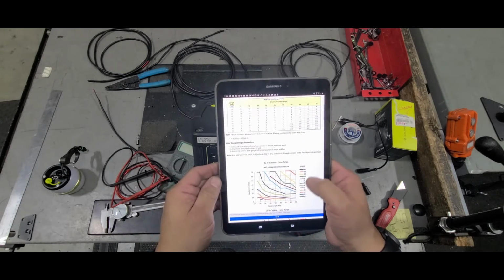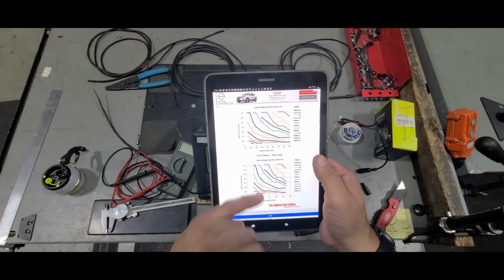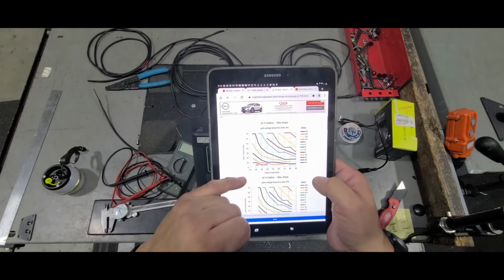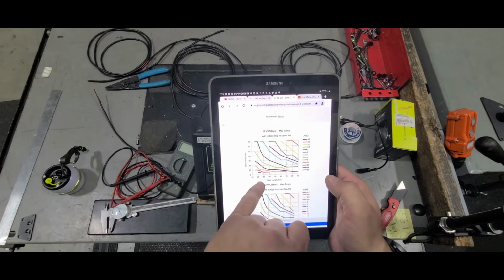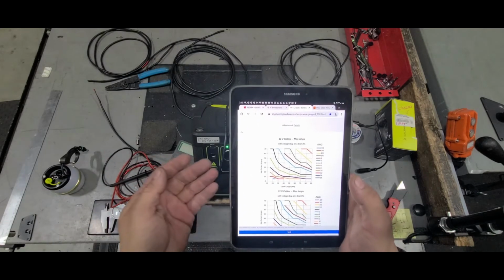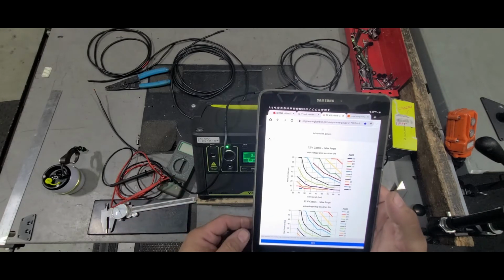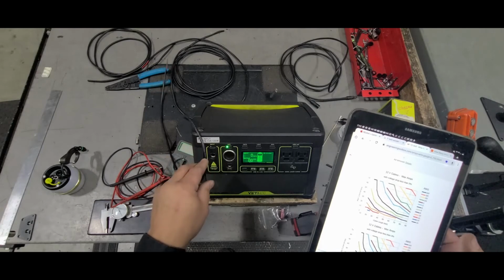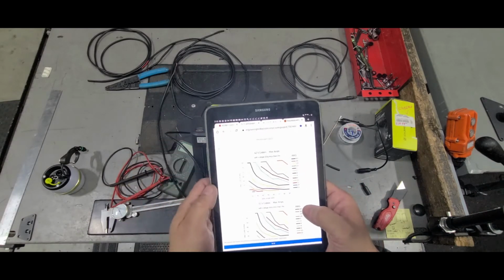And then this first table has to do with cable length in feet. The second table has to do with the same thing in meters. So you can see in the one with feet, it's telling you that 16 gauge is for 10 amps. I mean, you're good for like 40 feet. These lights, I think in a string of 8, on a bad day, may pull maybe 5 to 8 amps. Again, the wire gauge that Goal Zero uses is smaller than this gauge of cable. I don't think there's going to be a problem stringing 8 and using an extension. I think you're going to be fine. But if you want to geek out and check this, that's cool.